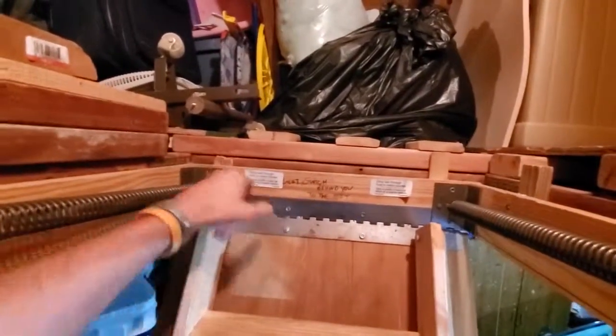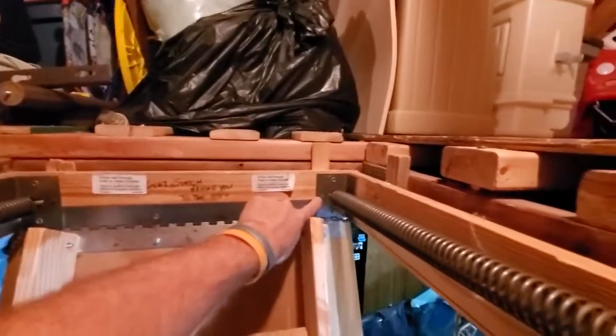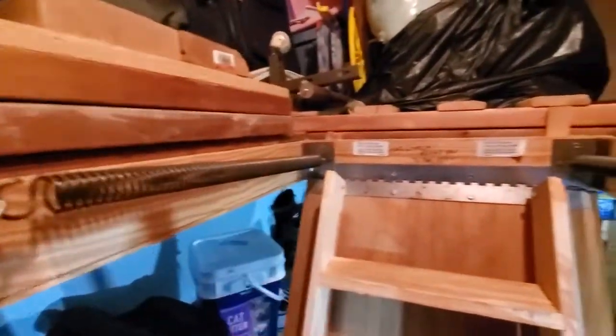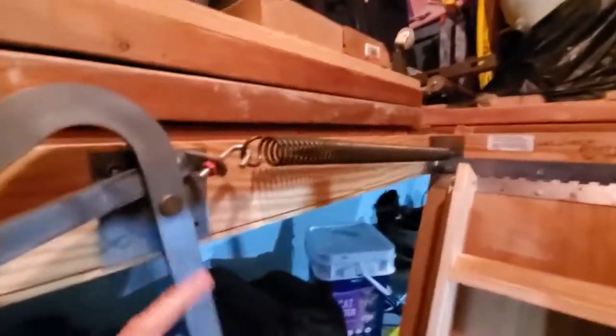Normally I'll see just screws, or people just put these up and don't even use the holes — they'll just kind of screw it up to the framing here. But you're supposed to use the holes in each of these metal brackets on all four corners, and then in the pivot plates here too.